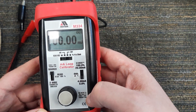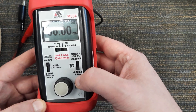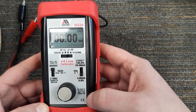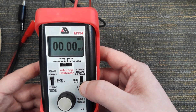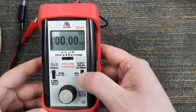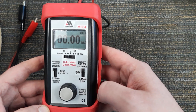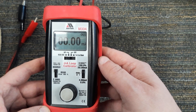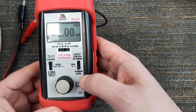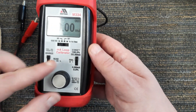The switch over here has zero percent at the bottom and 100% at the top — four milliamps at the bottom and 20 at the top. If I hook this up to a power supply, which I'll be doing in the next video, I can click just from four straight to 20, and as long as I have sufficient power and it can regulate the current, it should put it right on four or right on 20. The dial will function on any one of these three positions — whether I'm at the four, the middle dial position, or the 20-milliamp position.